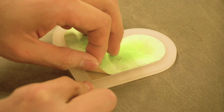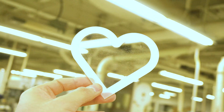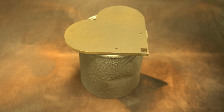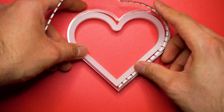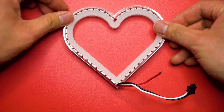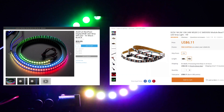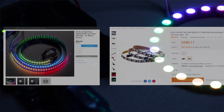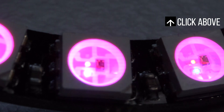When all the processes are done, remove all the films and you can see the final result we are looking for. I also spray painted the back piece with silver color to block all the electronics. With all the acrylic walls prepared, it's time to stack them up. Fold the LED strip inside and make sure you leave all the connections on the tip of the heart to feed through the back piece. The strip I used is NeoPixel, but you can also use WS2812 LED strips. I made a tutorial earlier for driving RGB LEDs with Arduino in case you need it.